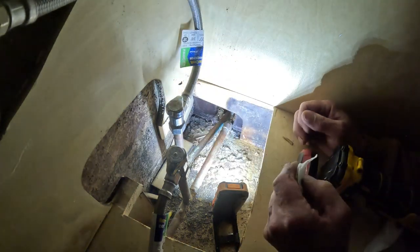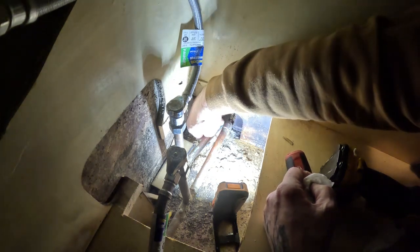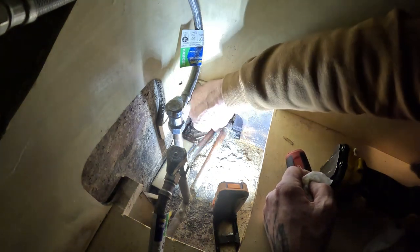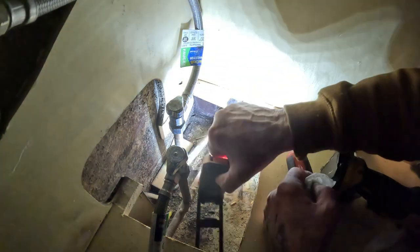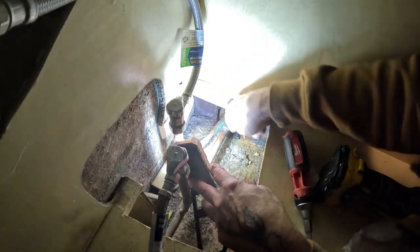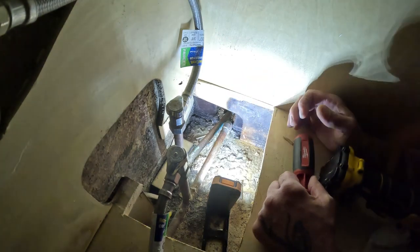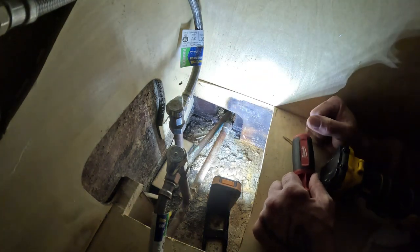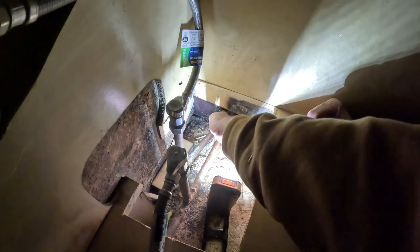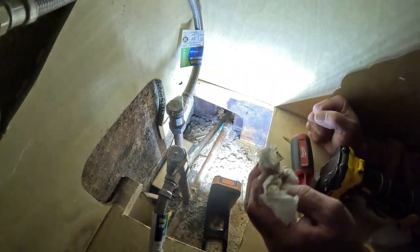You know, I think it might be this one leaking, and this is just leaching over onto this pipe, because it's got that green on there up on the side. So I bet it's this fitting right here. I bet you it's this one, because it's got a lot of solder on there. Anytime you see a lot of solder, that's bad.